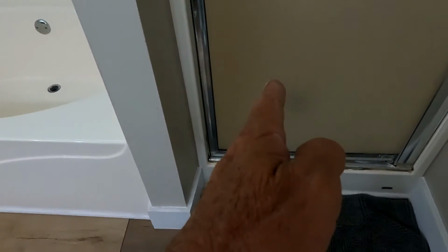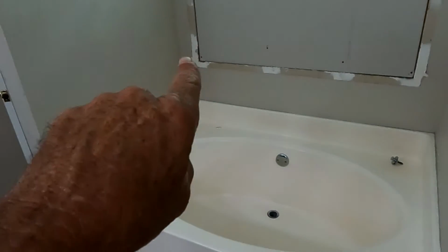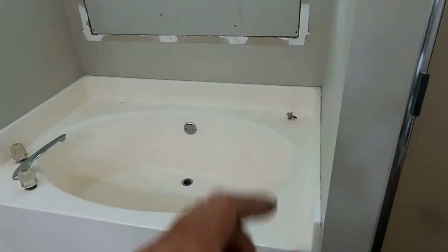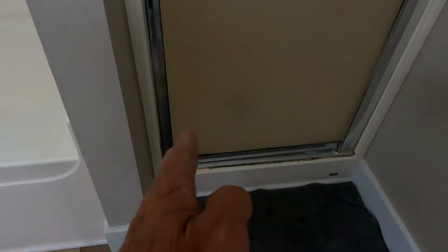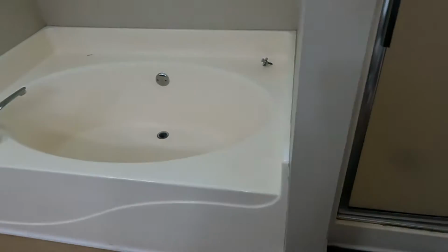We're going to go out 72 inches, because we have 12 by 24 tile, and the math works out that if we start on that end, we can get full tile, even though it's going to be staggered full and half, there won't be any type of sliver cuts or anything. Which is really cool that I can actually predict where this wall will go, because this wall is getting deleted as well. That's going down, and then I'll build a new wall at 72, somewhere around 71 inches probably, so we can get full tile in there, which is, you know, a good idea.